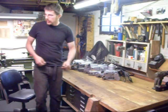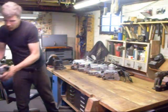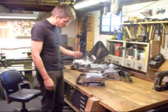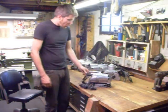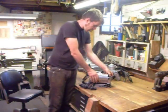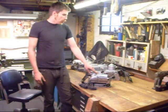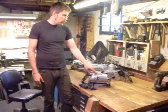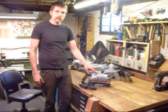Here I have an A3 sander, partly disassembled and due for some repairs, which I'm going to use to show you a couple of things to watch for. This sander needed repair because, as many of these belt sanders are, it was run without gear oil. The main thing to watch for, if you find one of these used and you can plug it in and run it, is if you hear a rapid knocking sound — chances are very good the brass gear in the gearbox is damaged.